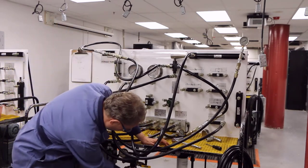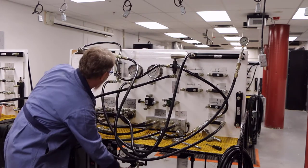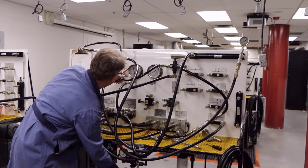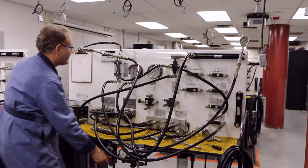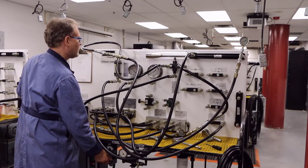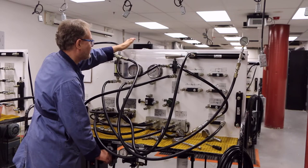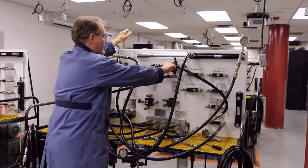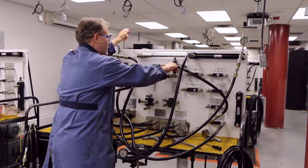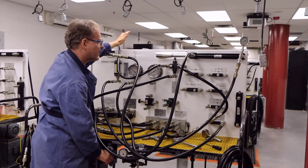Fire that thing up. I'm going to kick this up to 500. I can open this up all the way and just run this and see what happens. I'm going to make it go out. And now I'm going to do retraction. You can see it really didn't slow down there when it was getting to the end. Now what I'm going to do is throttle it — I'm going to extend this, then I'm going to crank the deceleration valve right up and then back it off a little bit. Okay, you did slow down a little bit. Let's do a little bit more.